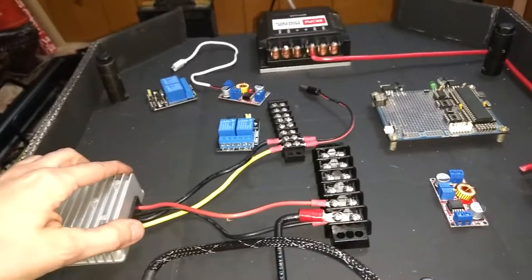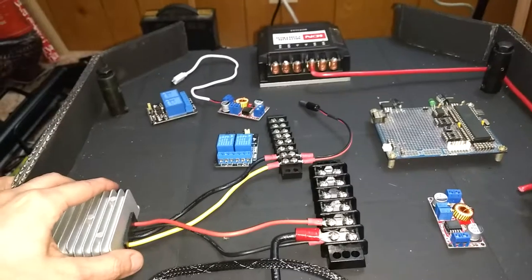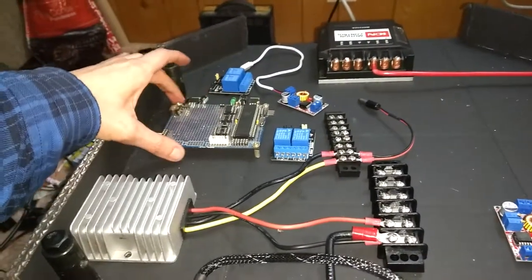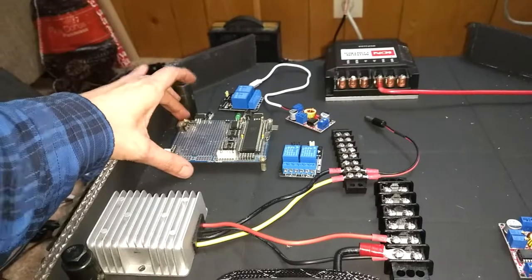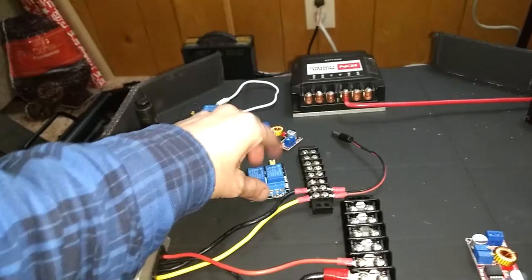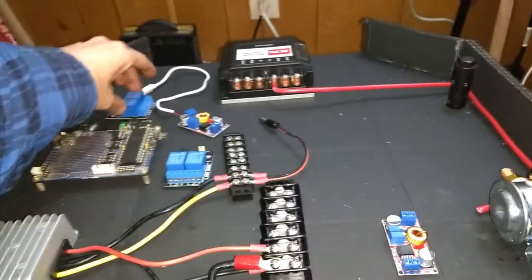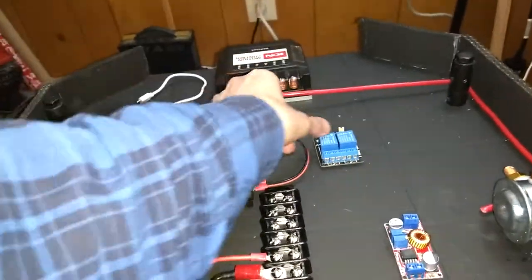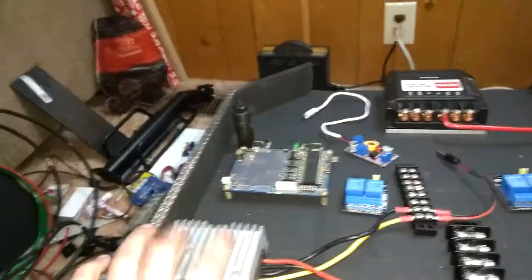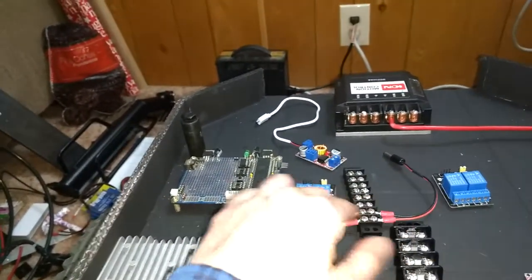It's going to be a Raspberry Pi 3 instead of a Raspberry Pi Zero, so it'll probably be about as big as this here. The motor brakes are going to be powered by these smaller types of relays. The Raspberry Pi is also going to be powered by one of these relays. The propeller is going to be powered by this here, which is capable of 20 amps, and all the power going into the relays is going to be off of this.